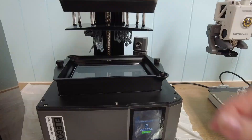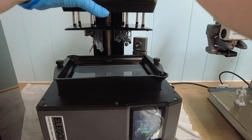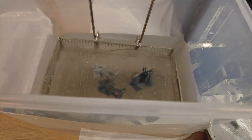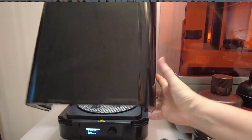Before you get all excited about that speed and detail, I have to tell you about the downside of resin printing. Resin in its liquid form is a toxic material that causes irritating fumes and rashes if it gets on your skin. You need to wear gloves and work in a well-ventilated area. We've installed a ceiling vent in my workroom to keep the fumes at bay and I've got a little air purifier to clear up the rest. Some people choose to print in the garage to keep this whole mess out of their house. Once the model is printed, you have to wash the extra resin off with isopropyl alcohol or something similar, dry it, and then cure it with more UV light to harden up that outer layer. Sunlight will work in a pinch, but a dedicated wash and cure station is a much better option. And remember — this stuff is toxic while it's liquid, so you cannot pour it down your drain, and you really need to invest in a lot of paper towels to help clean up. Once you put in the finishing work, cured resin is totally safe to handle.